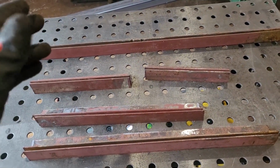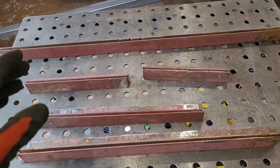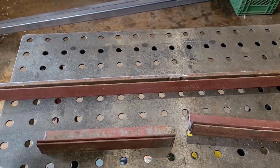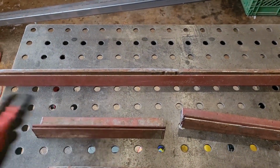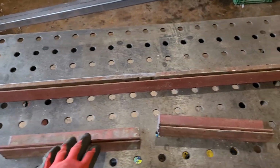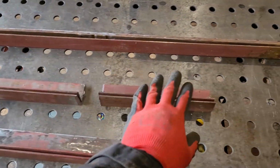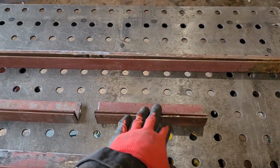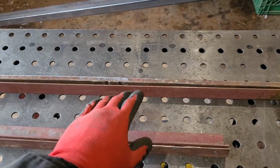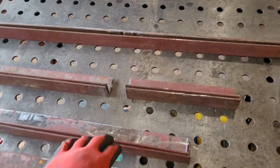once you sit on it, probably about 2 inches, that's what I'm figuring based again on some of the stuff that I have. So 18 inches was the height, made all the pieces accordingly for the height, obviously reducing the thickness of the seat. Like these aren't 18 inches long, they're 18 inches minus the thickness of the frame and the cushion and all that. So we'll see how that works. The back ones, because these are the front ones here, the back ones, I shrunk them 2 inches to give you that feeling like you're in the seat rather than just being on the seat, just to give you that feeling of being pushed in, so that way you don't have to feel like you're falling out.